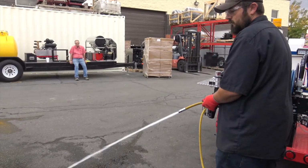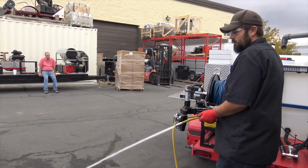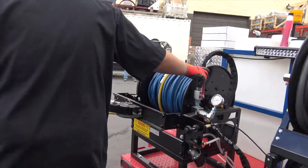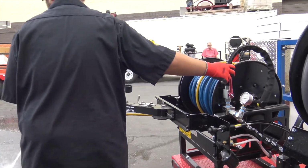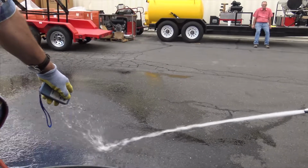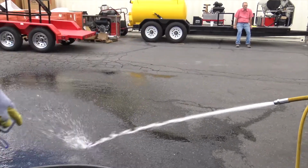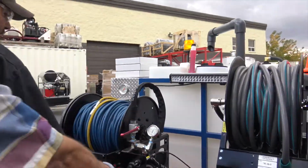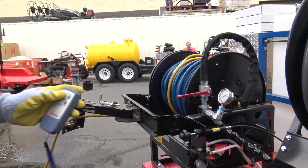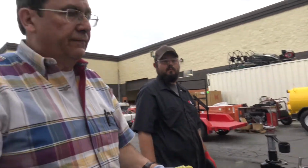We're gonna wait until we see antifreeze, and then I'm gonna hit the bypass valve, drain the tank, water tank, and every component's antifreeze. The heating coil, everything. Come on over here, Steve. You'll see as soon as that gets a little foam, you can put a little Dawn in with your antifreeze. We recommend windshield wash. This color will change right here. See? Then you hit the bypass valve. That's running antifreeze back into the tank. I'm gonna turn it off. And that unit's antifreezed.